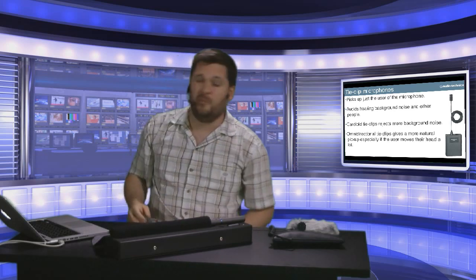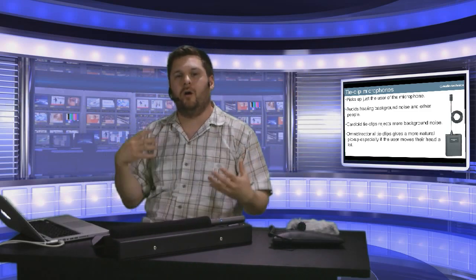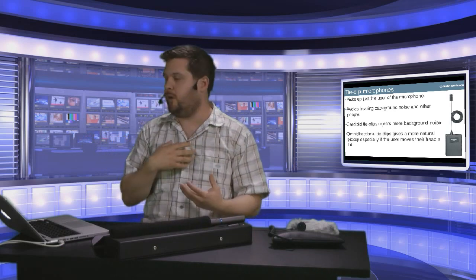You have two types. You've got your cardioids, so like a torch, it picks up where you're pointing it. And omnidirectional, so if I'm talking everywhere and move my head around, it's still going to pick up all of that voice work. It's not going to come in and out, moving around, so it's a little bit more natural. But the cardioid's a lot better for feedback rejection. So if you're ever using it with a live PA, the cardioid's a good choice for that as well.